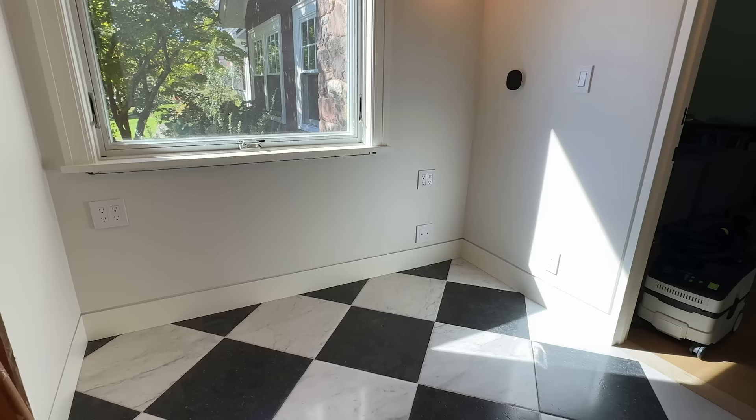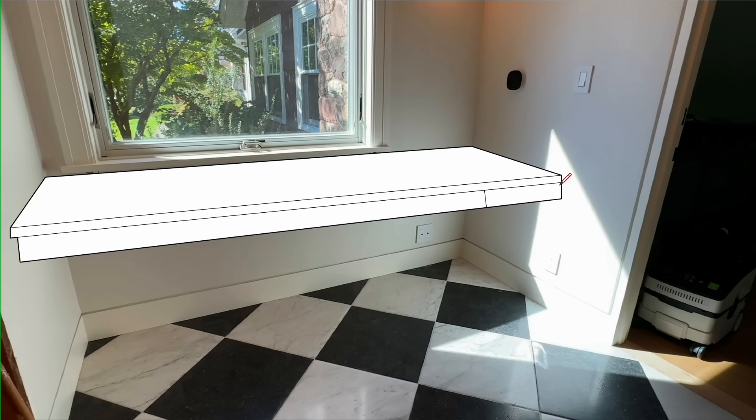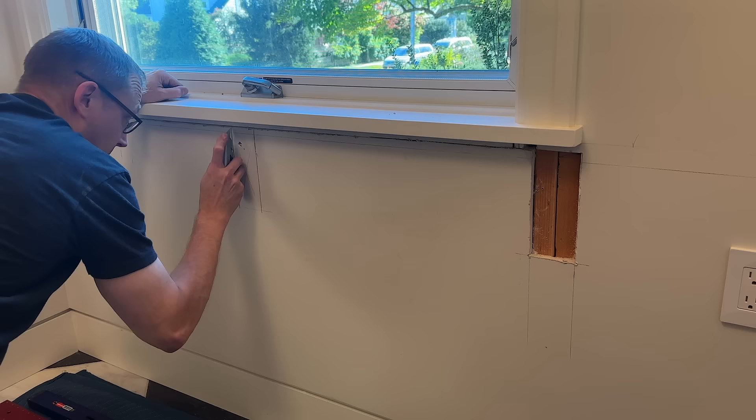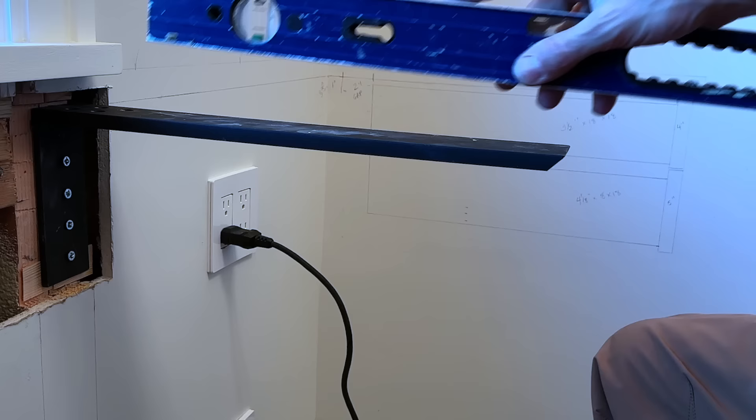That commission is a white oak floating desk with two drawers. Allow me to demonstrate using my proficient SketchUp skills — I have an apron, two drawers. But before I could do any building, I had to do a little site work by ripping open some drywall, routing out the studs, and hanging some countertop brackets, which will bear the majority of the weight of the desk in the center.